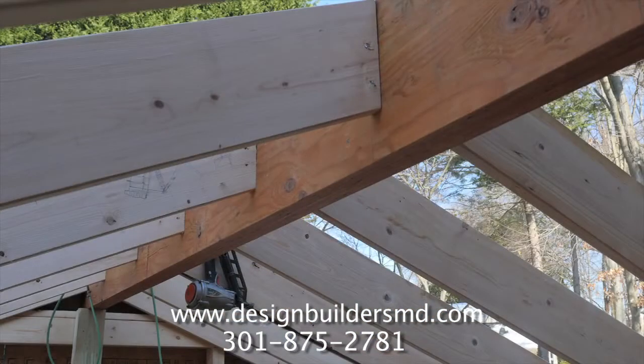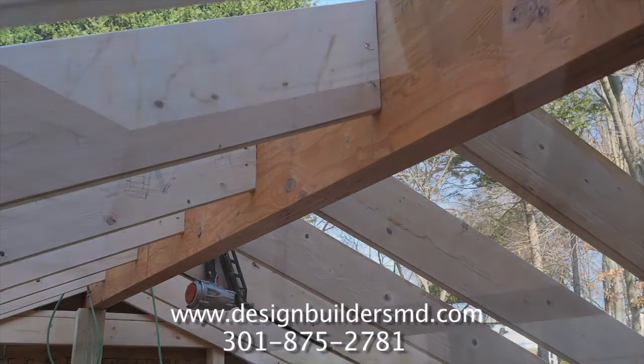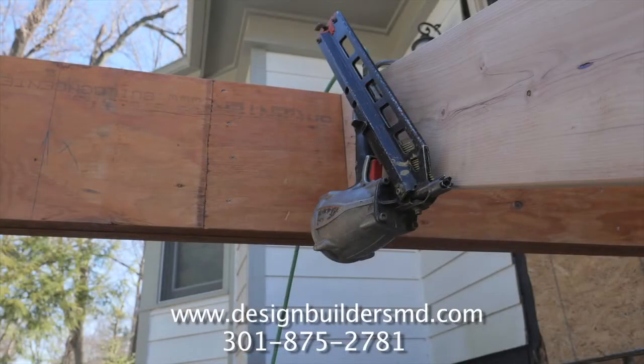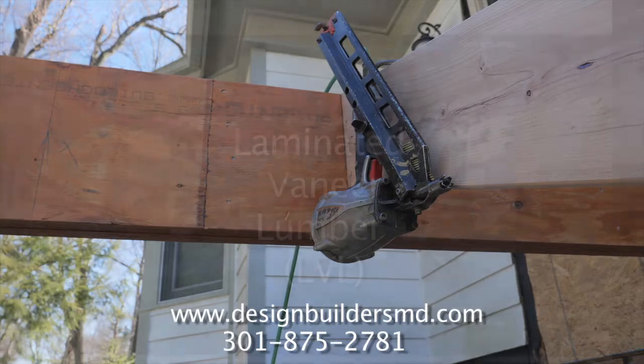Ridge beam is the beam at the peak of the gable roof. For framing an open cathedral ceiling, the ridge beam has to be rather substantial, typically an 11 7/8 inch LVL or a 14 inch LVL. All of the rafters tie into the LVL at its peak. Hardware is used to connect rafters to the LVL.